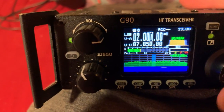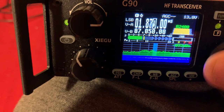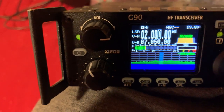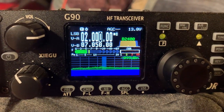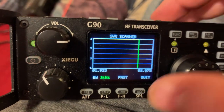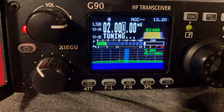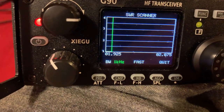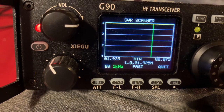Just listening on other frequencies around 1800. I have an antenna that's made for 160 to 6 meters. I've just got a lot of bends and kinks in it, so I think that's why my SWR looks so poor — up to 4. But the good thing is when I tune it, it tunes and allows me to communicate with only like 1:1 SWR, which is fantastic.